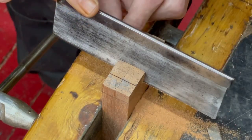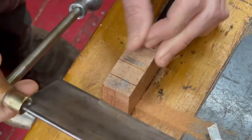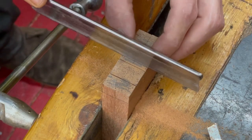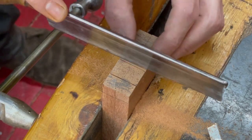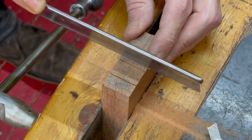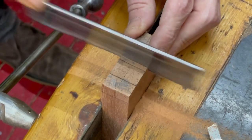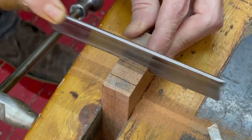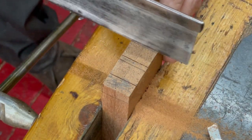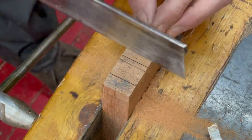And if you keep your saw straight, just get that wee angle straight, which again takes discipline, learning to know if you're straight or not. Other line. Get the angle. Line. I always use my fingers, so I just tip my fingers like that.